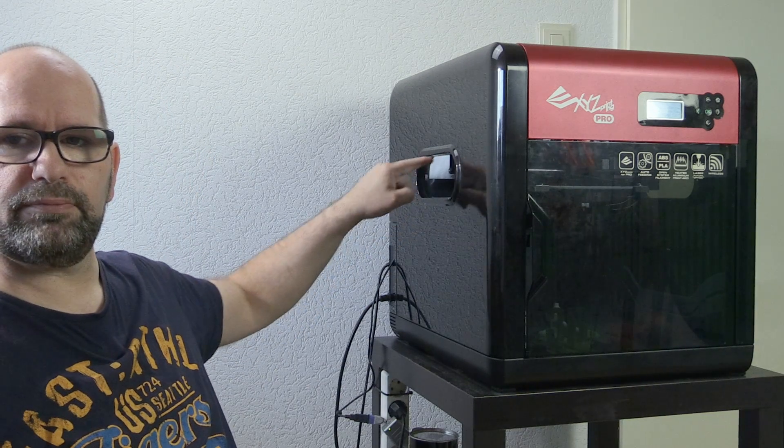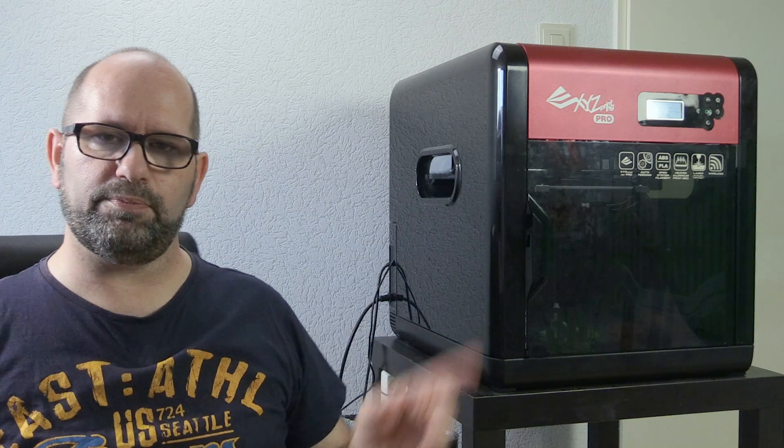One of the things you can do to make it cool down is place a fan in your machine. A lot of people are placing fans in the sides. And if you place a fan there, then everything in the machine will be cooled — your hotend and your bed will get cooled too — so you need longer times to get everything to the right temperature to print. But it does work. When you're cooling exactly at the place where you need to cool, it goes a whole lot better.